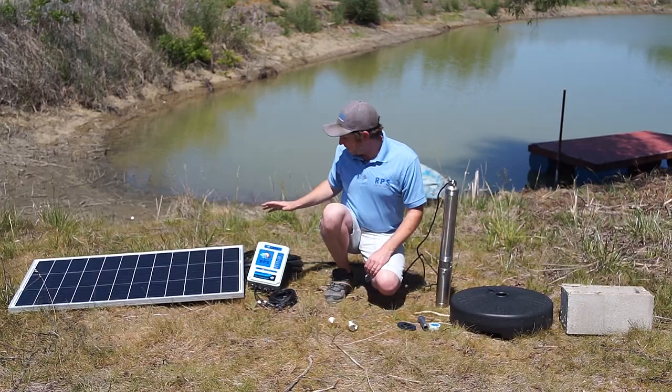There are a couple of items you'll need to purchase separately. One is wire, depending on the exact length of your installation. Today we're using 200 feet because from where our solar panels are going to be mounted, it's about 200 feet out to the center of the lake. You're also going to need a weight and a rope to hold the pump in place. We're going to use a cinder block and a piece of poly rope today — nothing special. You could use stainless steel wire, chain, or anything else to weight the pump down so it doesn't drift around.